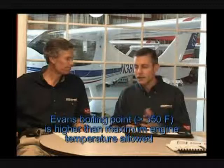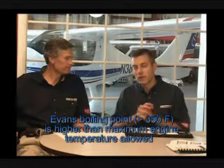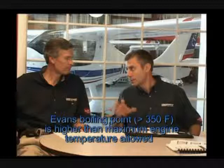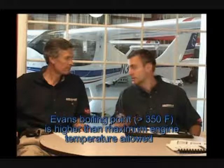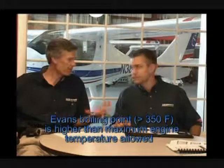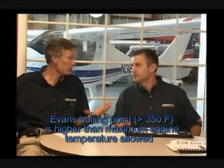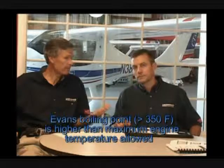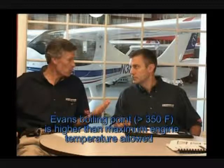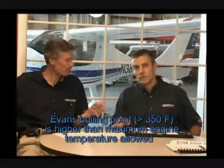Right. And in a case for perhaps a Sea Ray or a trike or some other pusher configuration airplane, where you might see high temperatures when you're taxiing around, that could be an advantage. Yep, absolutely, because if you've got a pusher configuration, and especially something like a Sea Ray where you might have to taxi downwind on the water, you could have almost no air moving over the radiator, and that's a case where you could overheat and perhaps temporarily get close to 300 degrees, and as long as you don't exceed that 300 degrees, you're probably not going to hurt the cylinder head.